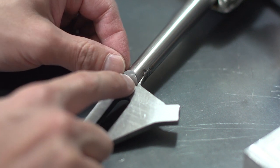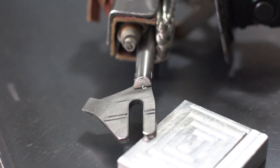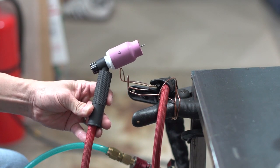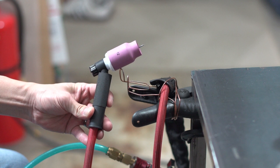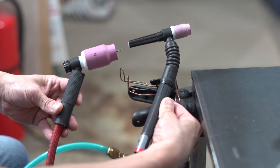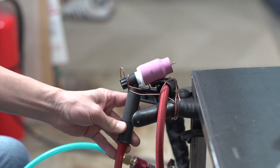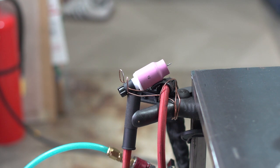So now with that all tacked up, I will tack this little cap on here. If you watched my earlier practice video on this subject, you might remember I did this step first. I've since realized it's best to do it later with the dropout already tacked into the chainstay. With the dropout on there, it gives the heat a place to go, so it's less likely to burn up the thin wall tubing. You guys may have noticed I've been using a different torch — this is my custom short handle torch made from a WP9 China import. Here you can see my old torch, and on the new torch I'm rocking a number 12 cup — a cheapo number 12 cup. I've been messing around with this setup and I like it a lot. If I decide to stick with it, I'll probably upgrade the cup.